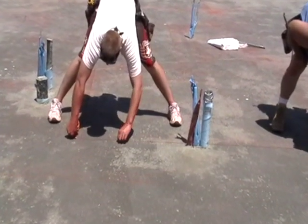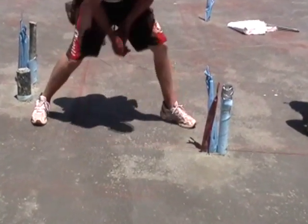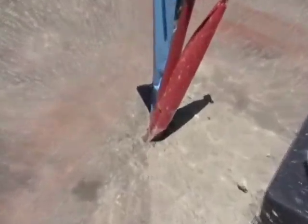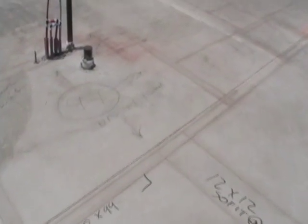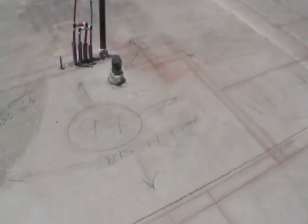The layout is going to be the roadmap for the framing crews to follow to build your house correctly. Included on that layout are going to be rough openings with measurements, wall placement, shear walls, connectors, details, and any corrections that are necessary.